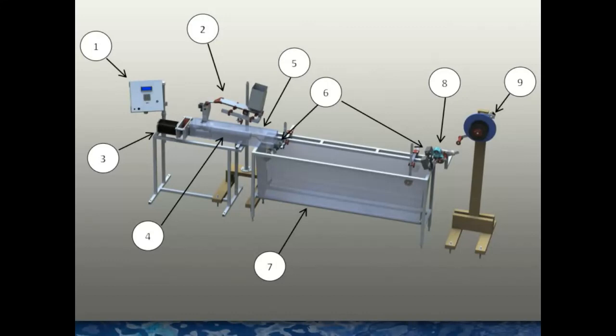For the quality of the grind - you said there were troubles when you have too many fines. Is that jamming the auger? The fines melt differently, and for example, the grooves cut in the feed throat - fines will collect in those grooves and keep the flakes from gripping. The grooves only extend down the barrel a couple of inches, where the plastic is still solid. So absolutely get rid of the fines, there's no way around that.